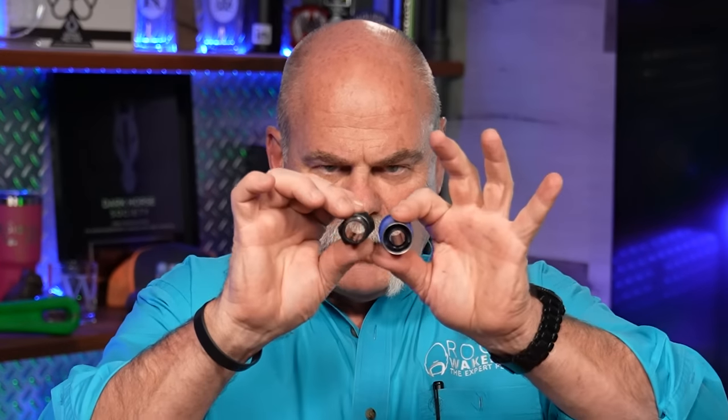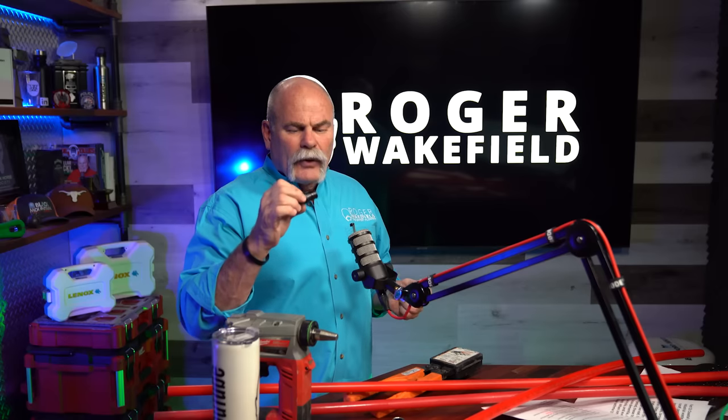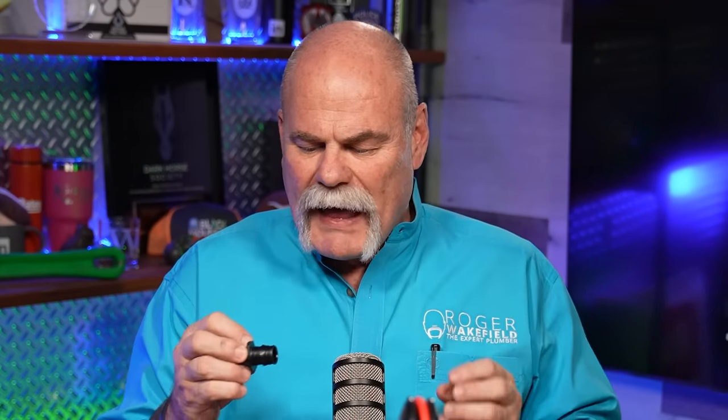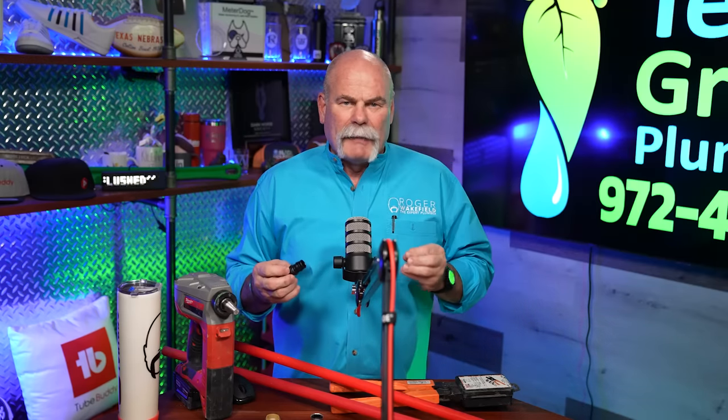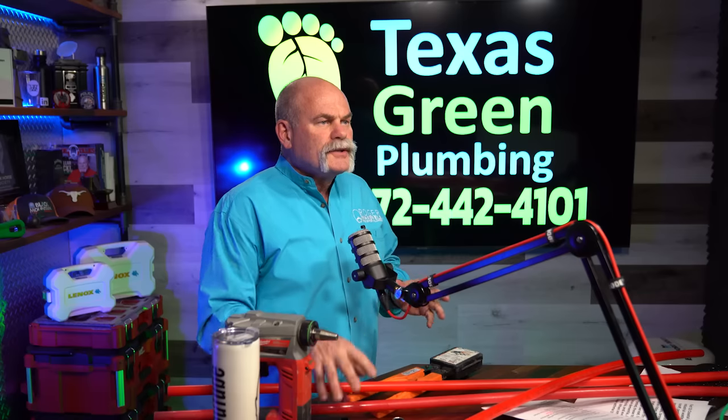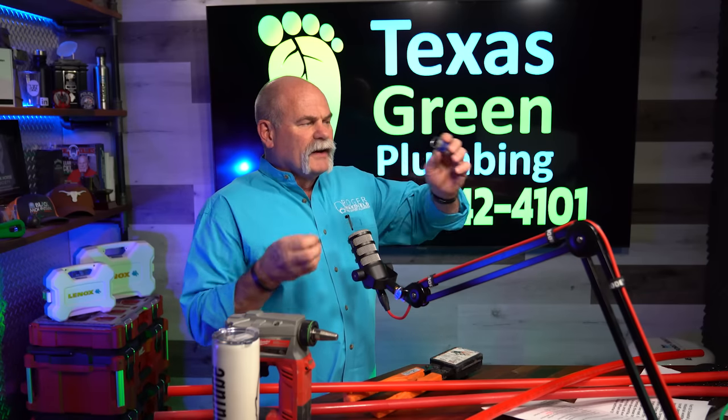So I prefer an expansion type. With PEX-A, you actually expand the pipe and stick the fitting on the inside. If you look at these, you can see the inside of this fitting is much larger than the inside of a push-together fitting. It actually expands, comes over it, and shrinks back down. For the rest of the lifetime of this pipe, it is actually trying to shrink back down to its original size.